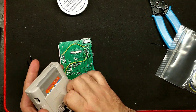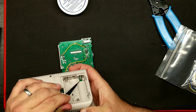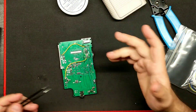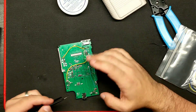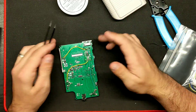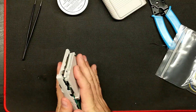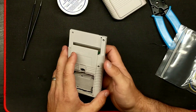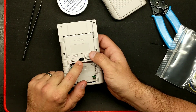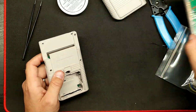An easy way to tell which version board you have: open up your case and look by the negative terminal — right below it, it will say V11D, indicating the 11th revision, REV-D. Once you're all wired up, you're good to go. Go ahead and replace everything back together. What's nice is not only will you be able to use your barrel jack, you'll also be able to use your micro USB. The same goes for the nickel metal hydride charging circuit — you can use the micro USB as well.